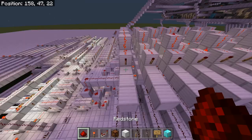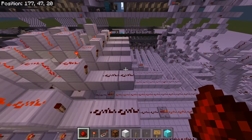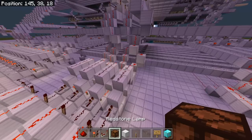And I now need to cut off the inputs from the opcode register and test that each of these is correct and in the right order. So it's really important that these decode signals are in exactly the right order because they tell us which instruction is which. And if I mess up the order, then anything we program the memory with will get decoded into the wrong instructions, and obviously then our program won't work when we go to use it.